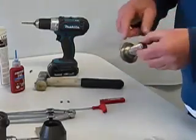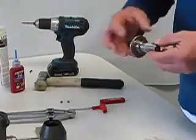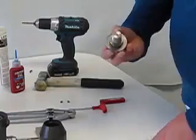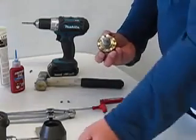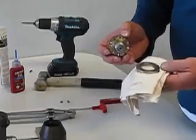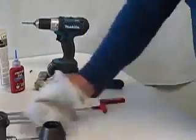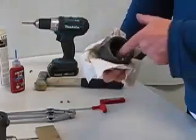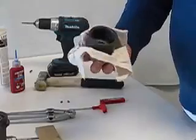If it was to be replaced we'd do a similar thing — with the butane we just heat up the thrust washer, it'll expand and drop off the shoulder. You'll have to heat it up again to put it back on, but pretty much the same process. Remember that on the thrust washer the words will always face away from the bearing surface itself, so the words go into the body. When fitting the thrust washer back into the body, you may have to heat the body to shrink it in — in this case it's still a little warm from what we've done earlier.